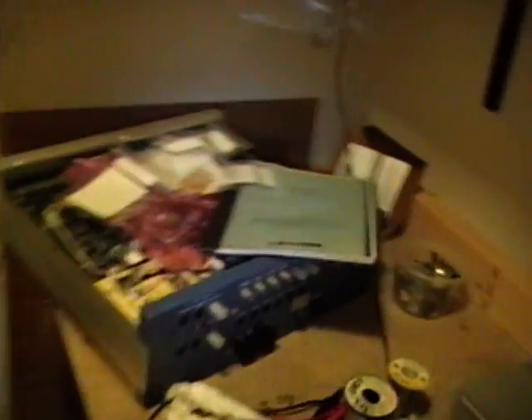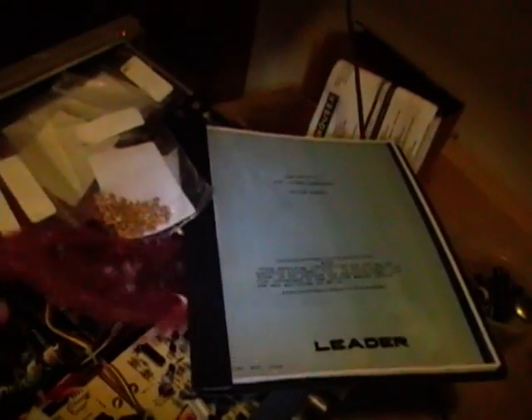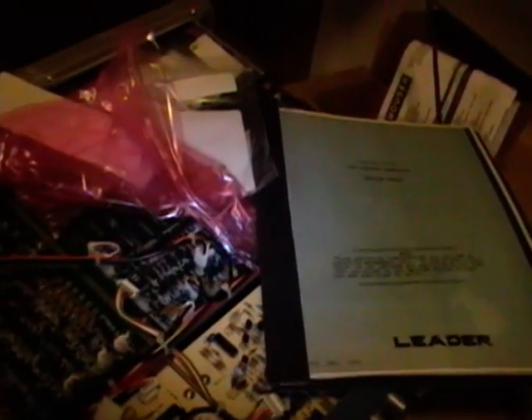But I have been keeping myself busy with a few little things. I did get the service manual for this Leader test pattern generator I showed in a previous video, and I started testing it out. While doing so, a couple more capacitors popped on me, so I decided I better recap the whole thing. I ordered a whole bunch — there are about 85 of them in total to recap. When it cools off a little bit, I'll get around to that.